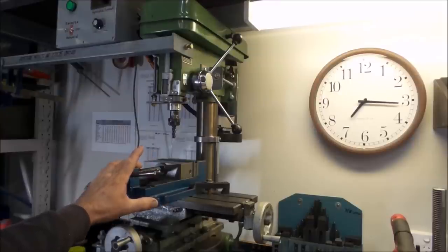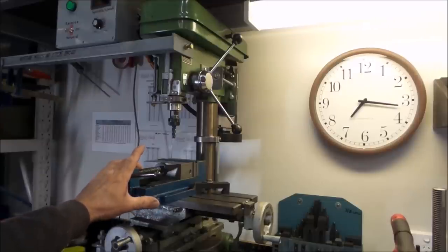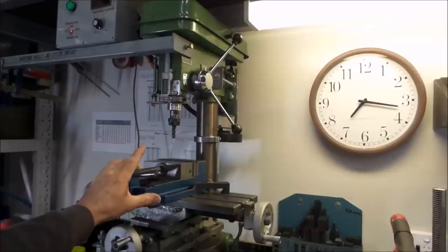It's no coincidence, ladies and gentlemen, that a mill is generally just a great big lump of cast iron, and a drill press, as you know, is not. And herein lies one of the biggest problems. How do I get my pissy drill press to act like a big lump of cast iron? The short answer is, you have to evaluate everything. Look for every area of weakness on your drill press. Everything that moves, work out why it moves and work out how you can combat that, with bracing and adding mass wherever you need to.